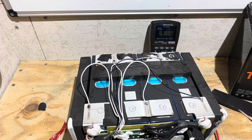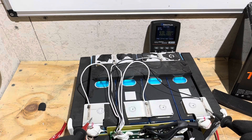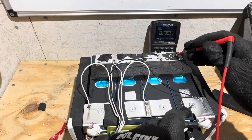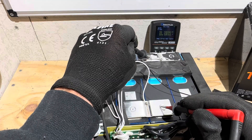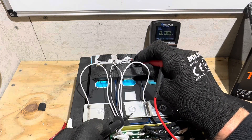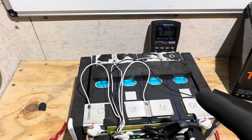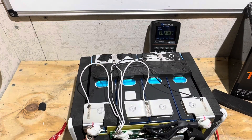I brought the battery up from the capacity test — I didn't want it sitting in a low state of charge for long to damage the cells. So at 13.2 volts, I just want to see how well the cells are matched or what the voltages are between the cells after that pull down. We're at 3.302 on one, 3.301 on another, 3.301, 3.302, and 3.301. So it seems to be a very well matched cell pack after a complete discharge and partial recharge. They're all pretty close together — I like that.